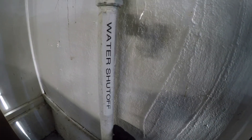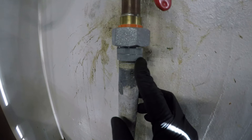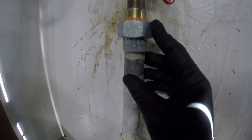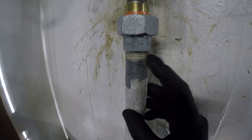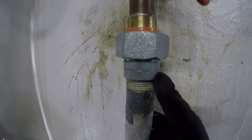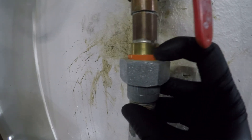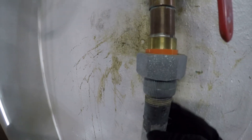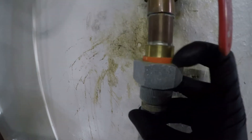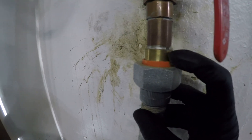Here's my main water shutoff. I decided to separate and start my copper piping here, so this galvanized pipe is threaded into this dielectric union, and this sleeve right here is what separates the galvanized metal from the copper. This part is actually brass.